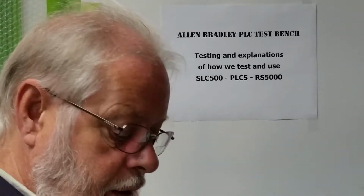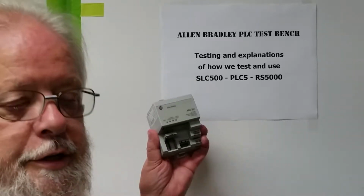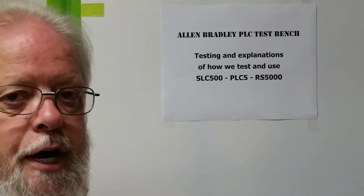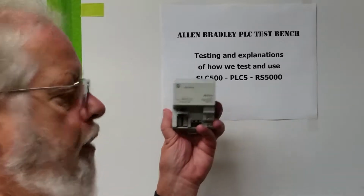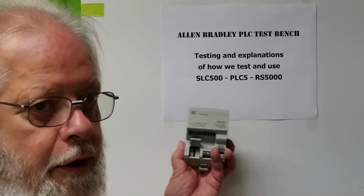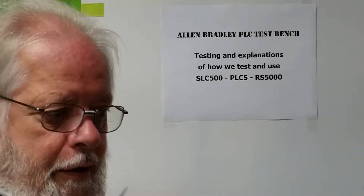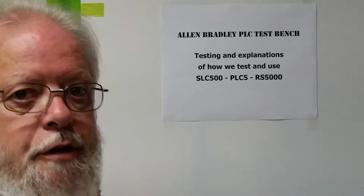And the other thing with the remote I/O is there's also the 1794 ASB, and they both basically do exactly the same thing. It's just a different format. It's a 1771 chassis, which, as we all know, was made to last 80 years, or the Flex I/O chassis, which were made to last 7 to 10 years. And some of them are lasting longer, some of them are lasting less. So keeping the old chassis up and running is a good thing. They're going to last you forever.